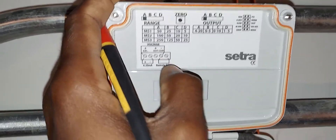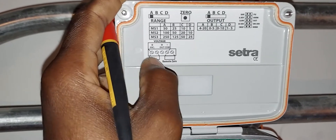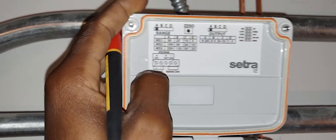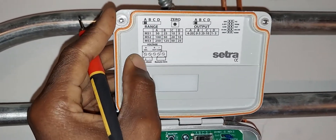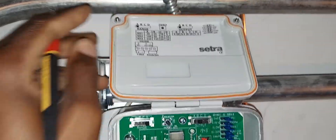You could also have a 0 to 10 volt signal, a 1 to 5 volt signal, or a 4 to 20 milliamp signal. If you're using 4 to 20 milliamps, you'll put your wires on the plus and minus terminals, but as shown in the manual it's going to require some additional intervention in the wiring.